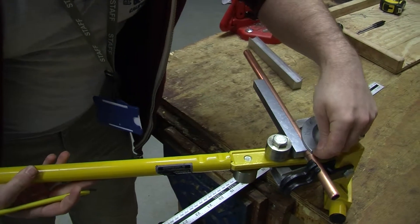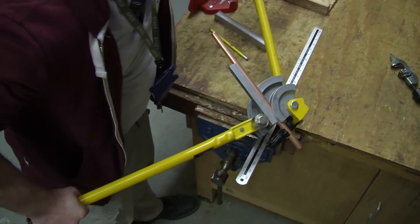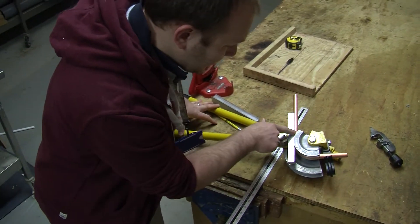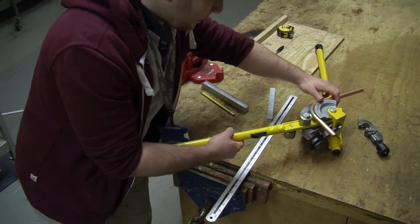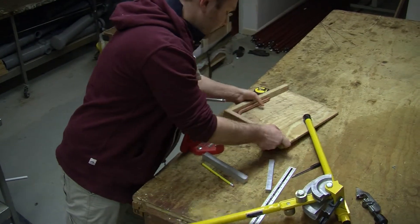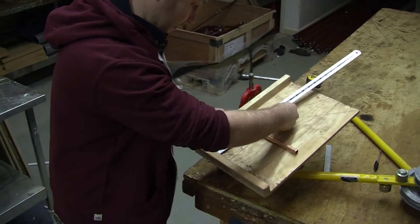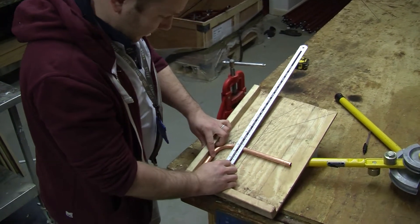The measure-back point is now on the shoulder of your machine. We bend it round until our mark for our 90 is approximately at the centre of the pipe. And then we have a perfect 90 degree bend, which should be exactly 150mm from end to centre.